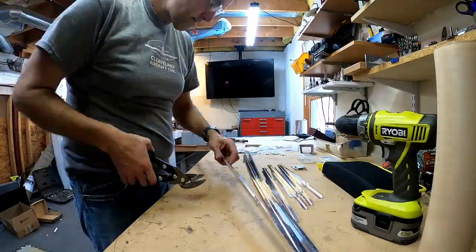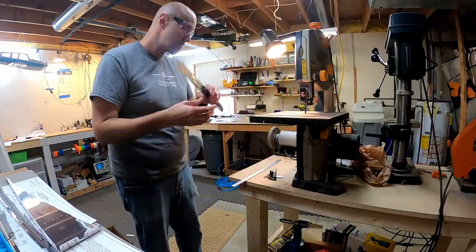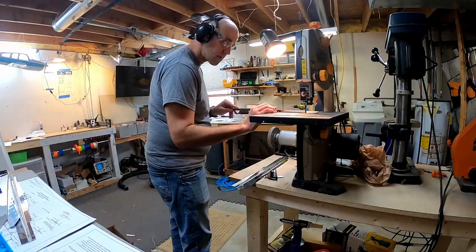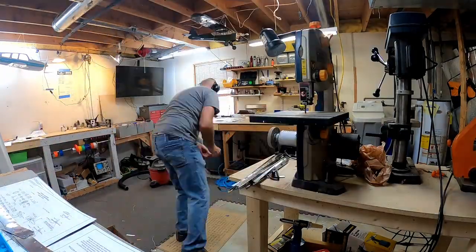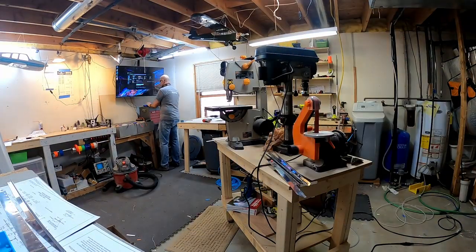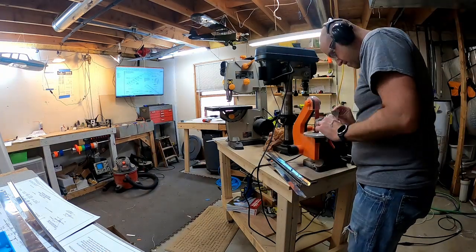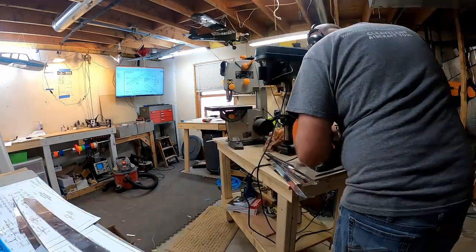Here's more of those little stiffeners I was cutting up with the aluminum shears. They come pre-bent and pre-formed, but you need to cut them a little bit more to shape. Also, when you saw aluminum on the bandsaw it is loud, so put on your hearing protection — it's just as bad as being in a GA piston plane. Cut them out, sand them down, and get them to the nice shape that the plans expect.